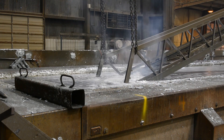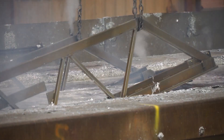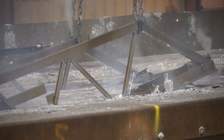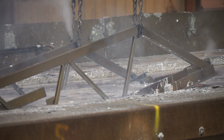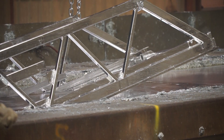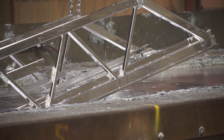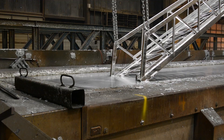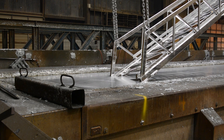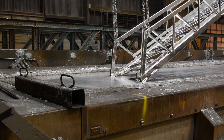From this process, it will proceed to our kettle. Our kettle is heated to 830 degrees molten zinc. This is where the galvanizing process starts. Once the ladder or any material is dipped into the galvanizing bath, it starts this process. Part of that process is best described in four layers. This is not a one-coating item — it coats the product inside and outside.